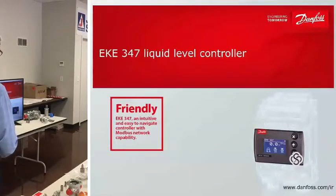All right, so EKE 347 liquid level controller. We've had this a long time on the old platform. You might run into one out there. It's similar. It's called the EKC 347, and as usual over the years, you have different generations. The latest is the EKE 347. And if that's not enough, I think Danfoss is planning to come out with a universal controller down the road that is going to envelop a lot of this. I don't know when that's going to happen, but for now, this is what we have.